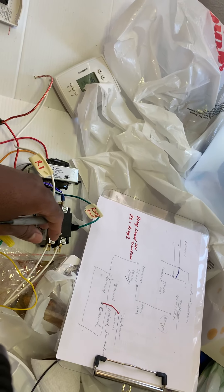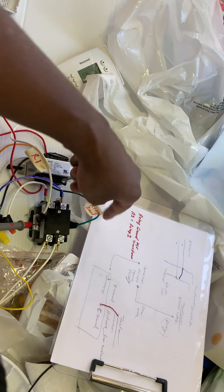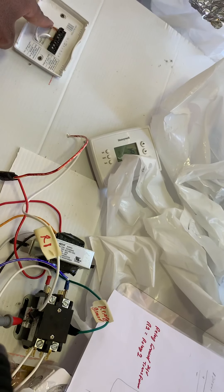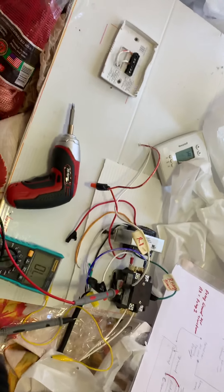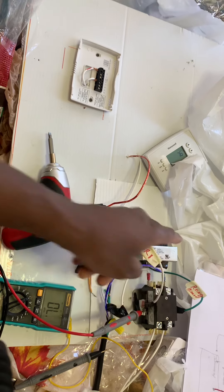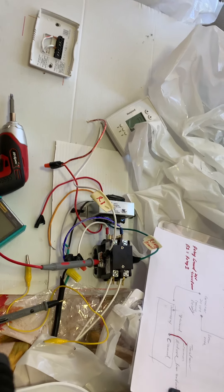That's why, when you're testing wires, you want to isolate it off your actual component. Because what could happen is if it's connected on the contactor and that contactor is shorted out, power could flow from this side of the coil to this side back to the transformer, which is connected back to the thermostat — and it'll give you a false positive. Your meter could go off regardless of whether there was a break in this wire, because it's feeding power through the other wire connected on the other side of the contactor through the transformer. So it's very important when troubleshooting wires that you isolate it off the component — physically remove the wire off the contactor, for example.